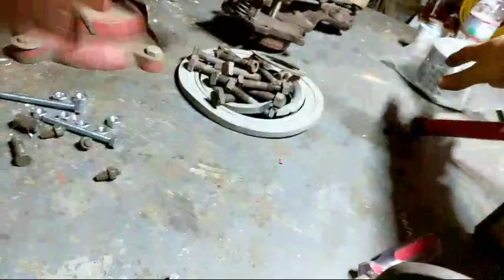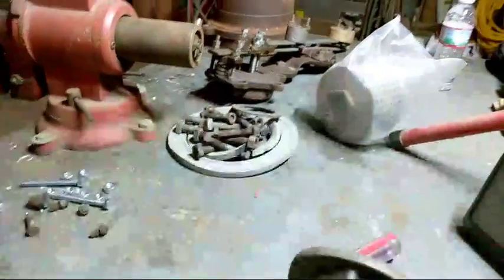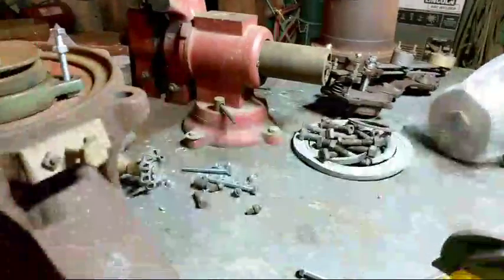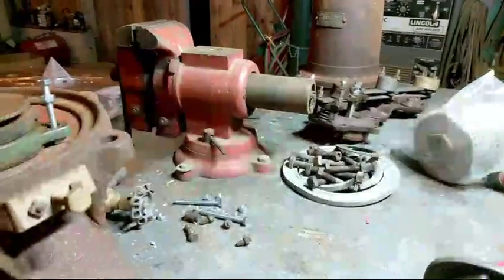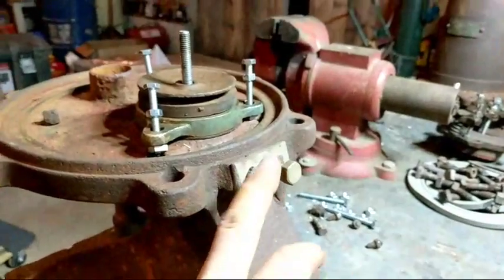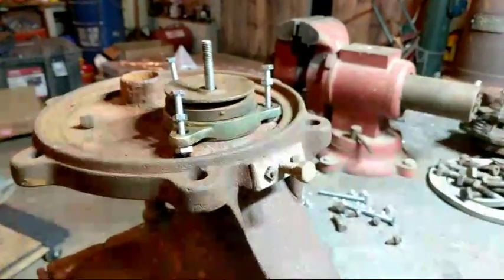And got an intake here for the ram. So if you got any questions or are interested in rams, I have Rife rams that I'm very familiar with. Davy rams is another smaller ram with less lift. And you can build your own ram too for about $100 to $200 with local parts. Typically those do not have snifters in them. And so if you get creative and figure out a neat way to put a snifter in, please share that with me.